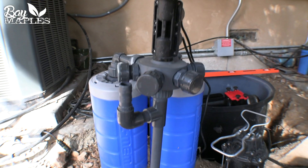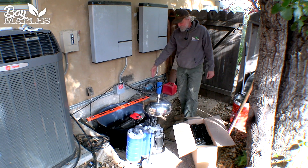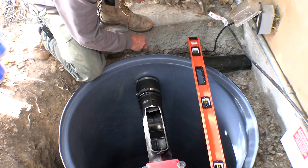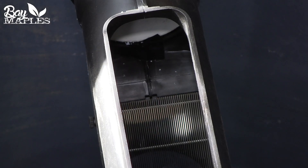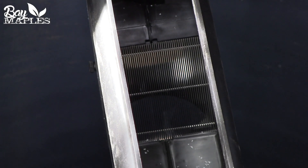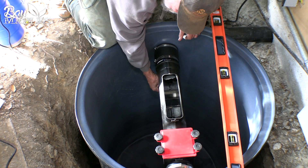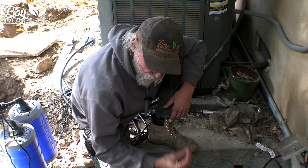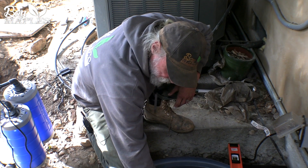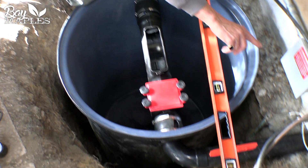This is really the heart of the unit. I have my tank here and there is a Pure Rain filter. The water comes in this way. There's a very fine mesh right in here and that's going to trap any sort of soap scums and hair and whatnot and keep it out of our tank. The water then just passes down through there. There is a little piece right here and a hose will plug into that, and periodically water comes on and shoots a hard stream to get that to flow this way — it will flow out of the tank and go to waste.